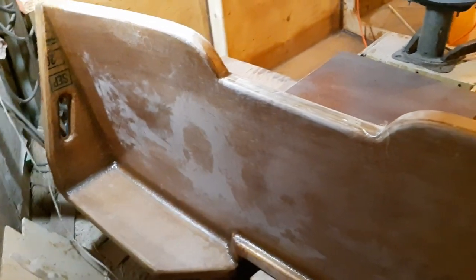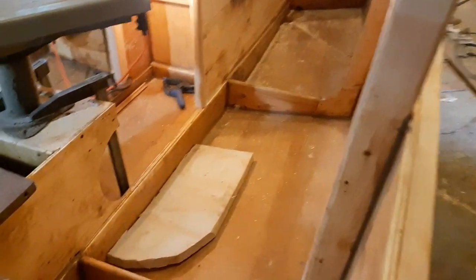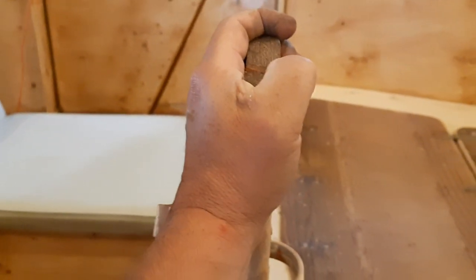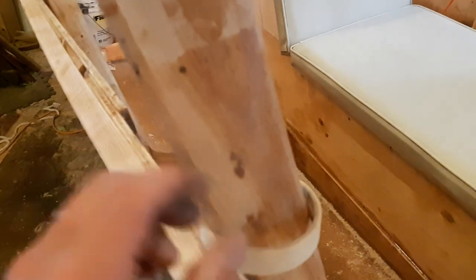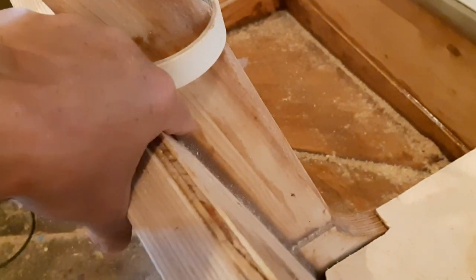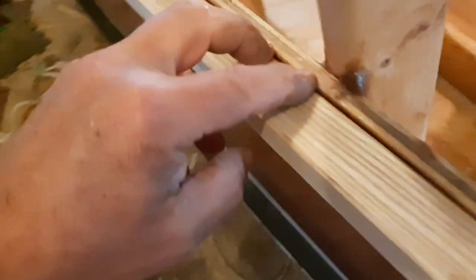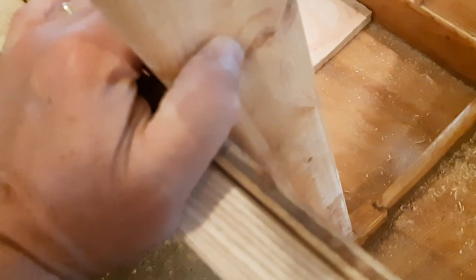The transom will be kept varnished — it's dusty but that'll come off. The upright frames are fairly light three-quarter inch spruce, basically from two-by-sixes. I kept them light so I could round the corners so there are no angles to deal with. With rounded corners you can just bend anything around it, then fillet the inside and you get a good fillet.